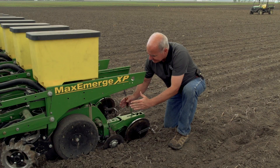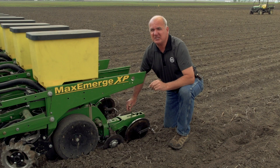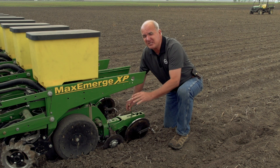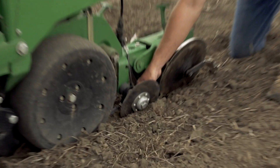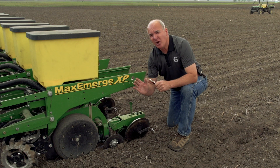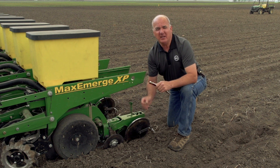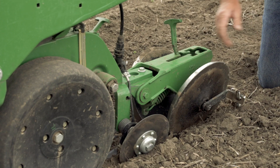As I look at the way this disc is mounted, it's got a camber to the inside — in other words it's angled in — which really helps us keep this trench open, especially in a dry spring like we're in here. I don't want dry dirt collapsing on top of the seed and affecting germination. We have a poly hose tube guide, not unlike a seed firmer — that poly guide keeps the hose positioned so it's always in the track that the disc is making, giving us very careful placement of that nitrogen at three quarters of an inch under the ground.